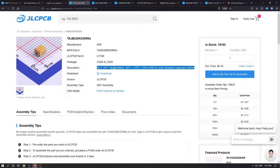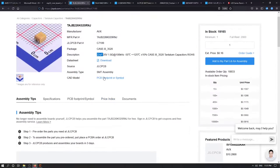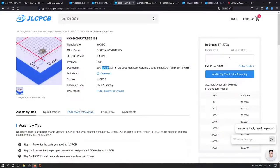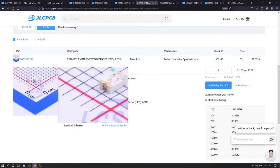We should use a 22 microfarad output capacitor — the right choice is this one. Then we'll use a 10 microfarad capacitor for the input, as well as two small decoupling capacitors on input and output. Next, we need to choose our LED diode. I will choose an LED emitting red light in 0805 format. To choose the right resistor, we need to check the forward voltage of the diode.